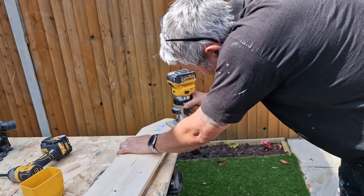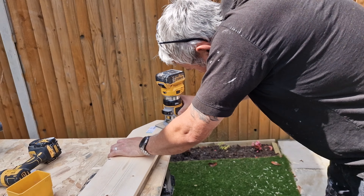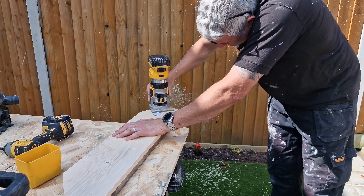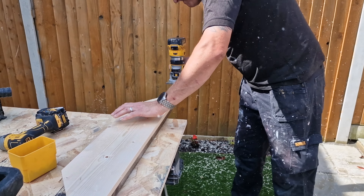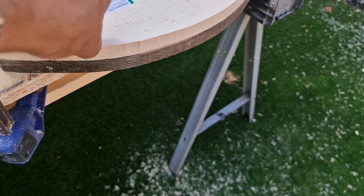This is the bit we're going to be using — it's a flush cut. Basically what you do is set it that way around, and then in one go you can replicate that exact pattern. Don't forget guys, always work away from you — never pull it towards you because it will kick out. So my bottom pattern guys, we'll start from there.